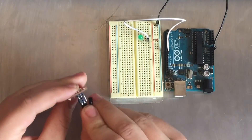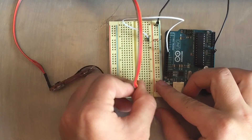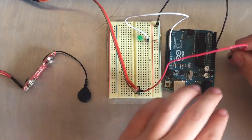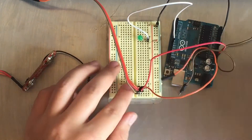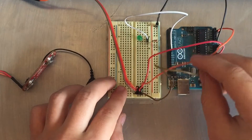After that I connected three wires to the Myoware's positive, negative, and signal, which I then connected to the breadboard. After that I connected the positive on the Myoware to 3.3V on the Arduino, the signal to analog pin 3, and the negative to ground on the breadboard.